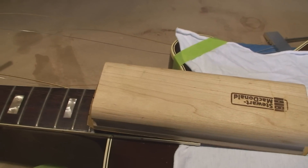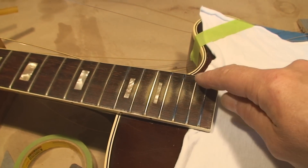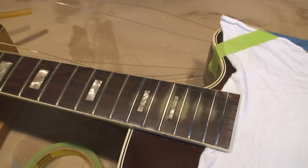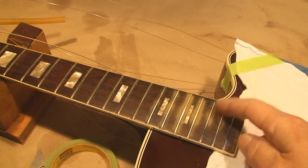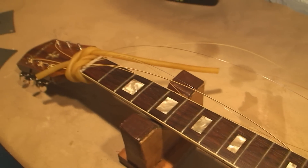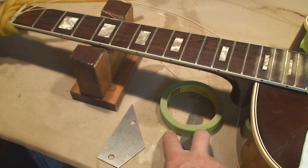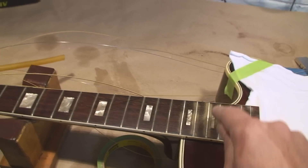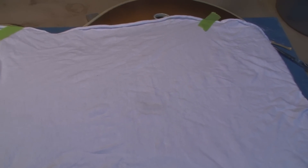Stand by while I do repetitive motion that I'm not supposed to do. You can see after a little bit of carving how it's taking away the blue where things are high. There wasn't enough repetitive movement for any sort of a happy ending so I'm still okay — that's pretty much that. Now I've got to re-crown them and repolish them. This is why it's hard to do this stuff unless you've got the right tools: files cut down small, radius blocks, crowning files to make the frets the right shape again. That should do it, and next I'm going to show you how we're going to shape the bridge — then this thing's going to rock.